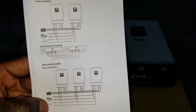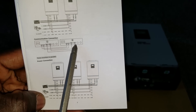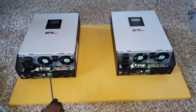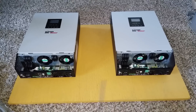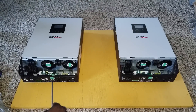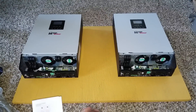When you parallel this, you jump in the current, which increases the amperage and it becomes a big giant 10 kilowatt. With the VGA communication cable, it's the same thing — from the first port it travels to the last one. So it's coming from the first port of the first inverter to the last port. This one here goes to there — a male to a female, a female to a male. These are the only ones that go the opposite direction, from the first one to the last, and from the second one to the first — interconnected.